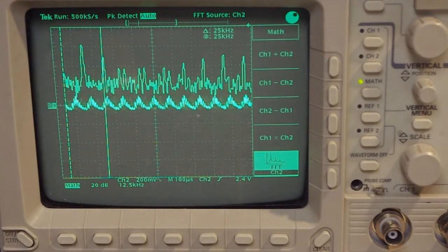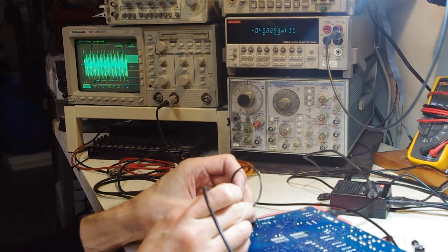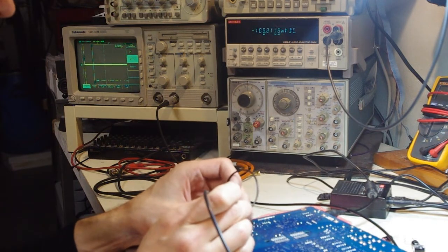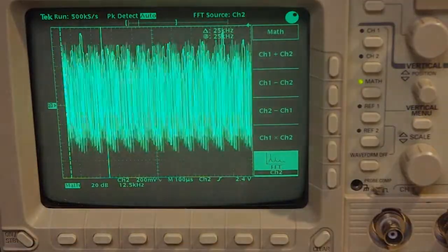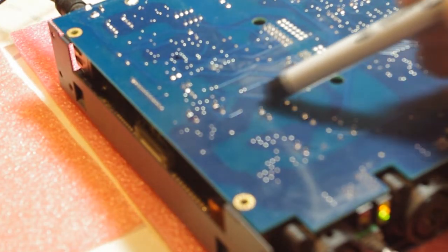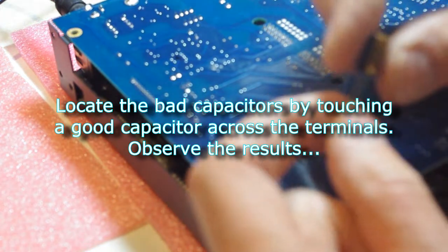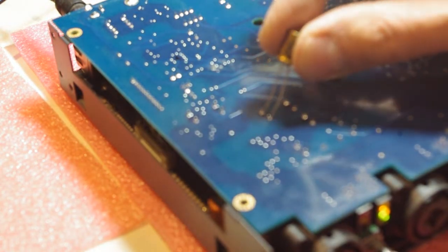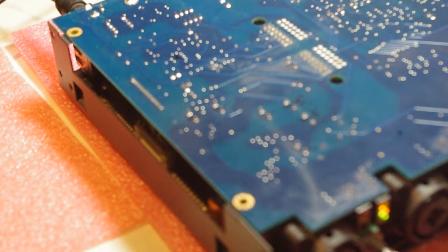There's 13.7 volts with a little bit of ripple and noise — another 13.7 volts at about one volt peak to peak. Nasty 12 kilohertz. And that's about half a volt peak to peak of nasty noise — that looks terrible. Here are the ones giving us problems. If I take a good capacitor and drop it across one of these — particularly the one at five volts — I don't hear 12 kilohertz anymore. My ears are much happier. I think all I need to do is recap this. When I remove the new capacitor, that ugly noise comes back.